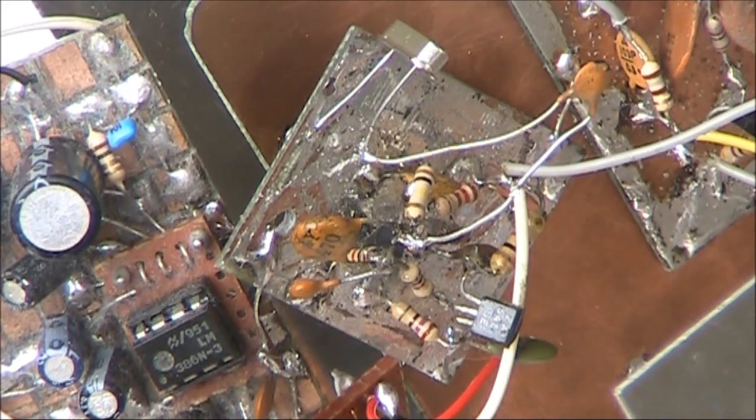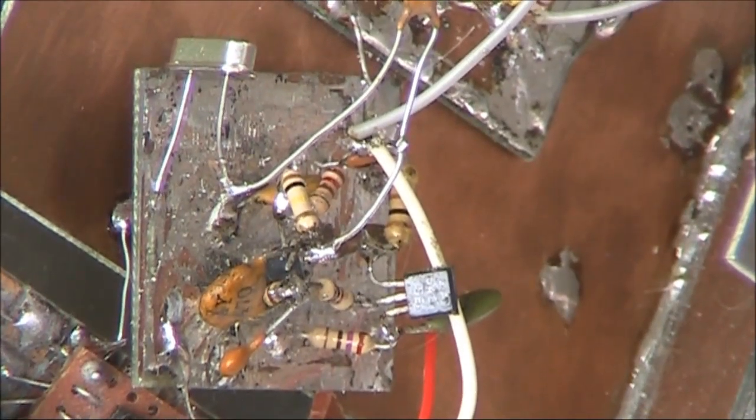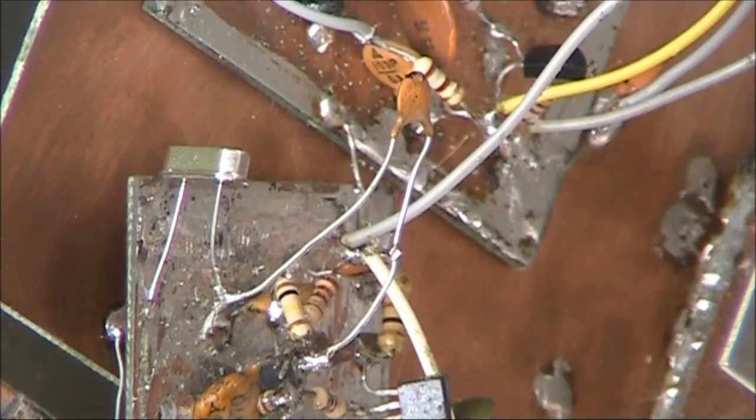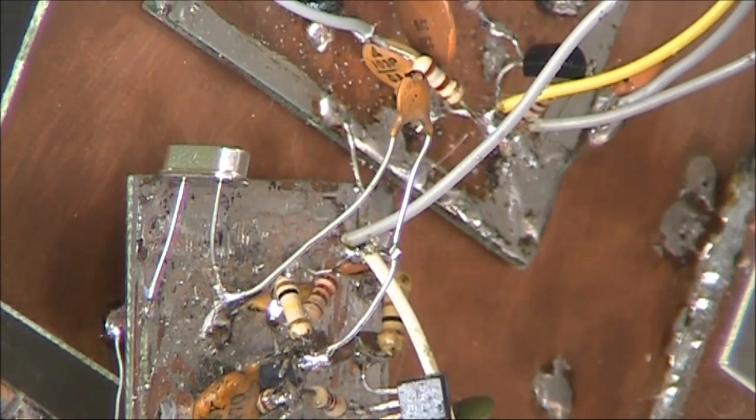The product detector gets its driving force from a BFO using a 4.032 MHz crystal and 1 transistor for the oscillator and another for the buffer amplifier, exactly the same as for the 11 MHz local oscillator. You'll see there's a disc ceramic capacitor with quite long leads connecting from the crystal to the base of the oscillator transistor. Changing the value of that capacitor, which is only a few picofarads, allows you to change the beat frequency oscillator's output frequency.